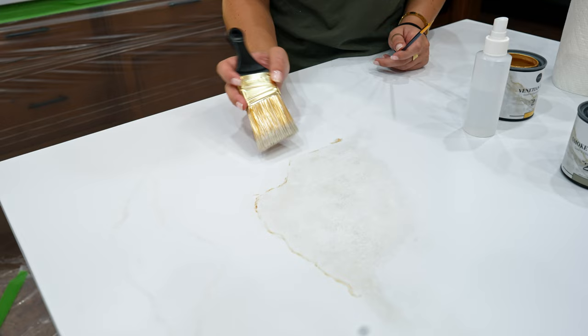Before you apply the epoxy, be sure to block off the room from any pets and small children. Now you're ready to apply the top coat. Giani Quartz comes with 3 sets of epoxy, and each set is made up of 2 parts, a liquid activator and a liquid resin. Each set covers a 6-foot section of countertop.